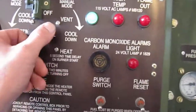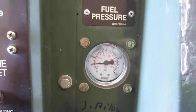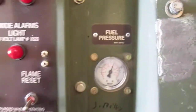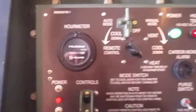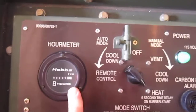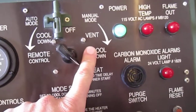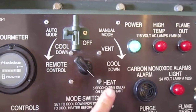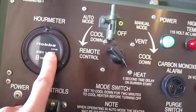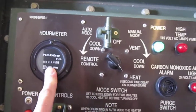Let's go back and kick this into heat again. Remember it's about five seconds on the burner, fuel pressure comes up, and then you can switch. The hour meter will only show hours when the burner is running — it has nothing to do with the regular fan. When the burner is on and off within its cycle, the hours show how many hours the actual burner itself is running, not the fan.